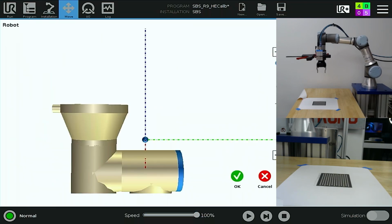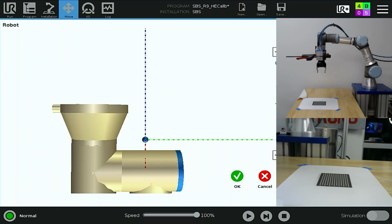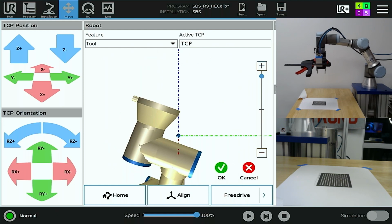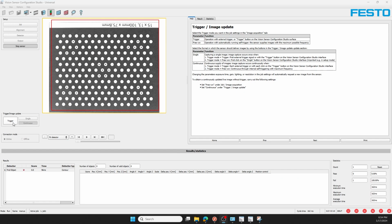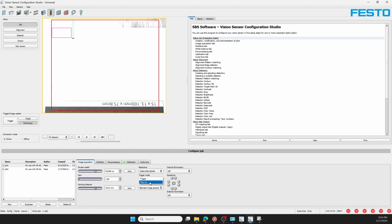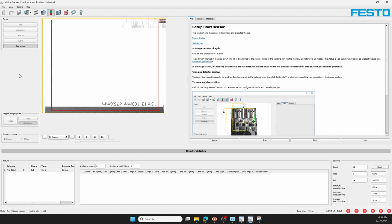Now I'm going to rotate away from image pose by at least 20 degrees or greater in at least one major axis. Here, I'm manually inputting a 20-degree offset about one of the major axes of the TCP. But in inputting that 20-degree offset about the TCP, you can see that my calibration grid has fallen out of the field of view. I'll put my program over into free run for just a moment so that I can reposition this second waypoint.